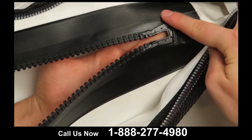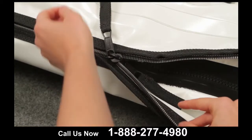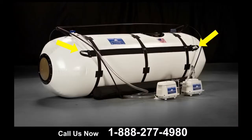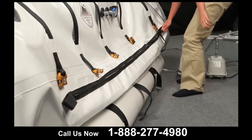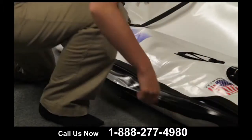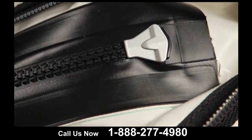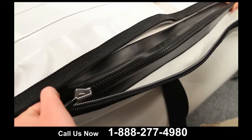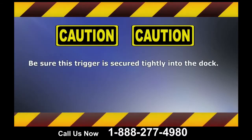There are two horseshoe-shaped docks at each end of the airtight zipper. Next is the structural zipper that features only one trigger with a pull on the outside and a pull on the inside. Next are the handles located on the outside at each end of the zippers to assist when opening the zipper. When you receive the chamber, it is configured for outside operation. Open the chamber by the outside T-shaped pull on the airtight zipper. When closing from the outside, the inside trigger is completely closed and secured in the dock. The outside trigger will be pulled to the left and secured in the same type of dock. Please be sure this trigger is secured tightly into the dock.